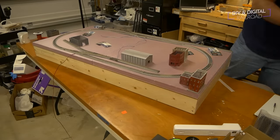Now I feed the 12-volt LEDs into the holes we drilled in the first episode. Now normally I would solder these connections, but to keep it as simple as possible, I'm going with a solderless method for attaching wire. We will be twisting the wires together and sealing them with heat shrink tubing. I really like this wire because it comes with heat shrink tubing, zip ties, and even a wire stripper. I'll link it below. Once we've stripped the ends of the wires, we twist them together to attach all the necessary wires in the same fashion.